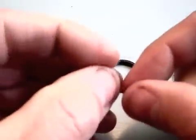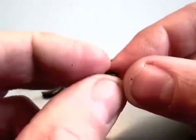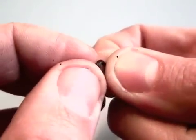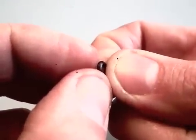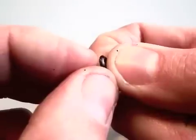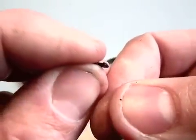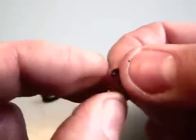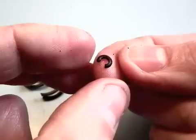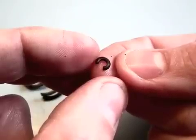The seal which most often goes on your air gun is the inlet valve seal. It goes because - if you look at how misshapen that is - when you're filling your air gun up, the air around this seal actually gets excessively hot, probably up to 100 degrees plus. You're filling your air cylinder quickly, the air goes in, it's excessively hot and there's a lot of pressure - thousands of pounds per square inch - and it just cooks the inlet seal. It's the most common repair any gunsmith anywhere in the world will do on a PCP air rifle. The best thing to do is to fill your air gun as slowly as you can, just stand around and wait a minute or two whilst it slowly fills up, and that will preserve the life of this seal.